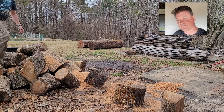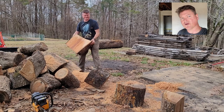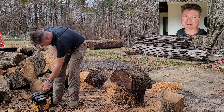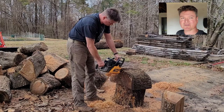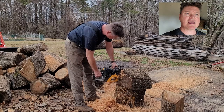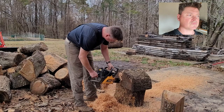That's firewood. And so you need something that's really capable of pulling an 18 inch bar or larger. And then again, what is firewood? Firewood is typically hardwoods. I know a lot of you guys in the Pacific Northwest got your Doug fir, and I've heard that's pretty hard stuff, but it ain't a hard maple. It ain't hard oak or anything like that. It's still Doug fir. It is what it is. You might be able to get away with a 20 or 22 inch bar on a 50 cc saw, no problem, and that's fine if you can do that. But for my situation, nothing smaller than 50 cc, and I'd probably prefer it closer to 60 cc's. I want to be able to pull a 20 inch bar really well, and in a pinch be able to pull a 24 inch bar.